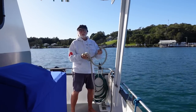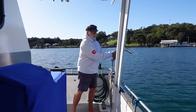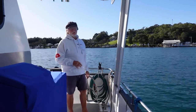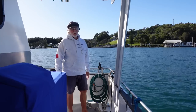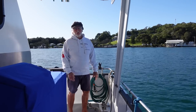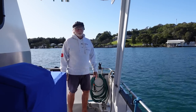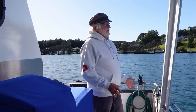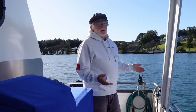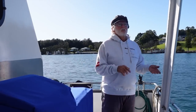The plan is when I get to the dock I'm going to drop that loop over a cleat on the dock and that's going to control the boat from there on. Whether it's going to be the stern line first or spring line first is something I'll have to work out — it's probably going to be a spring. So fenders are out, the lines are set up, now we're going to go in to the dock.